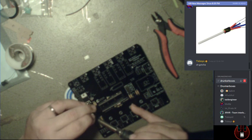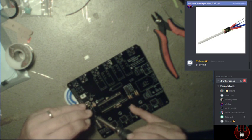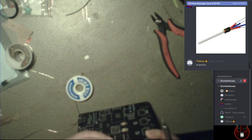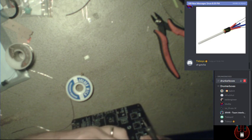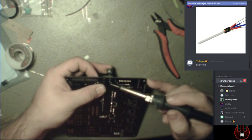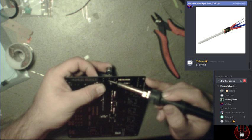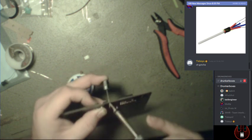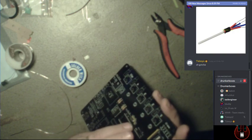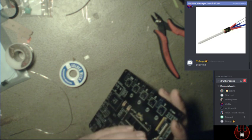I think that's a ceramic element. Yeah, I'm pretty sure it is. Wait, a ceramic soldering tip? Is that a thing? Yeah, the heating element that goes underneath the metal is usually a ceramic core like that. And then you'll have iron, and then a copper plating over the iron, and then over that you'll have chromium. Once you get through the chromium, your tip is fucked.